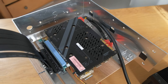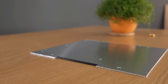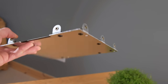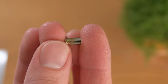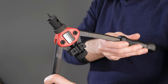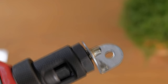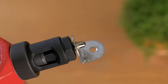So now it was time to make the platform for the motherboard. Again, I used some aluminium for this, onto which I screwed some right angle brackets that had some threaded inserts added. These threaded inserts are something I've only just become aware of actually, and I wish I'd known about them before because they're just so useful. You do need a tool for them, and they work by being threaded onto its tip, after which they can be pulled and crimped inside a mounting hole. It's really nifty, so if you guys want to do this too, I've put a link to the tool in the description.